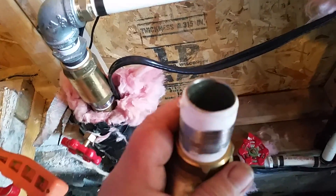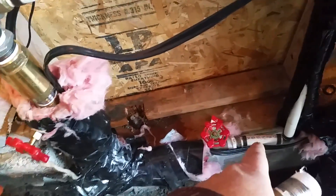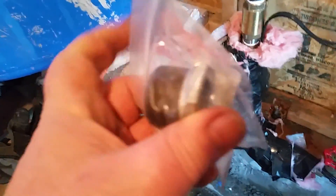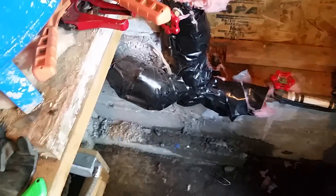This is a one-inch fitting. My faucet down here is a one-inch fitting — the valve — and this is three-quarter-inch pipe. So this will go in this direction of flow, the way I'm pointing. This will screw into the faucet, and I have this reducer — one-inch down to three-quarter — which is going to go right there. By the time I put all that in, I'm going to be about to here where this elbow is.